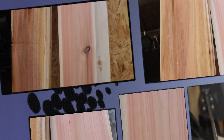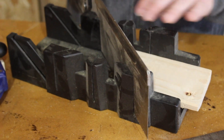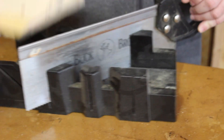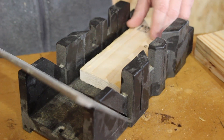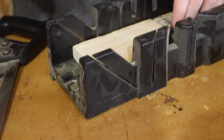This miter box is actually plastic — we have two of those. As you can see, there is already a setting for your miter in the box in two directions, so you just set it and forget it. You can do either direction miter. It makes a very good miter. There is also another way to miter in the other direction in the wood — you can set it here and miter this way. That is the cheapest and easiest, probably the longest way to do it because you have to use hand tools, but it is definitely doable, especially for trim material that is not very hard wood.